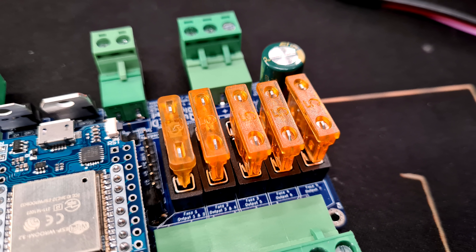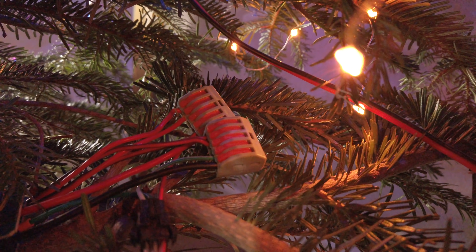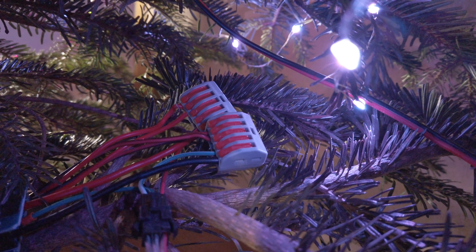Basically, power terminals 1 and 2 run over fuse 1, and 3 and 4 run over fuse 2, and the rest of the terminals have their own dedicated fuse. Depending on your LED setup, you can either use the five individual terminals and fuses, or use the combined terminals for some of it. This way, when you require 15 amps of total capacity and you have three power injection wires — especially with 5 volts — you can wire those over three times a 5 amp or 7.5 amp fuse instead of one big 15 amp fuse, making the whole installation a lot safer.